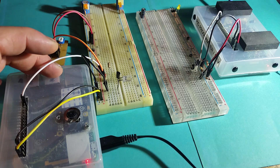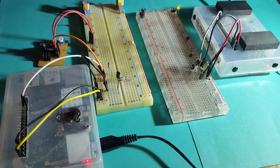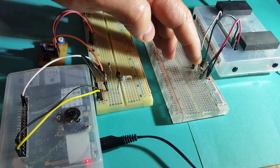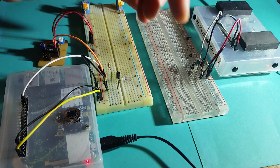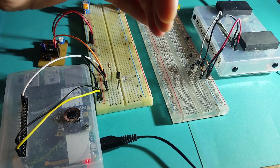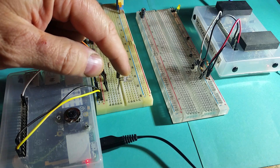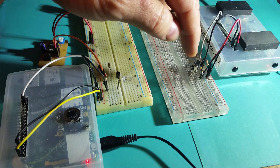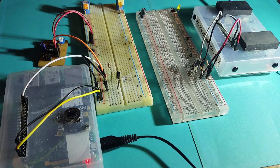I've got two Raspberry Pi computers. This one on the left is connected to a breadboard with an infrared LED for transmitting data, and the Raspberry Pi on the right has a breadboard with an infrared receiver. It's not just an infrared sensitive device — it's got circuitry within the device that receives only frequencies of 38 kilohertz. So you have to transmit 38 kilohertz from the LED to change the level of the output. The output is held high, and when you transmit 38 kilohertz, it pulls the level down to ground.